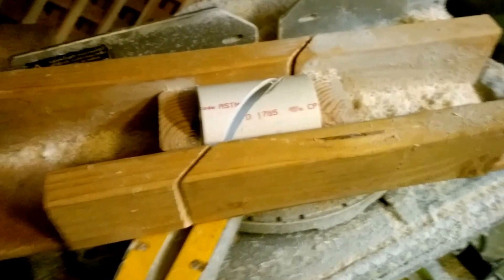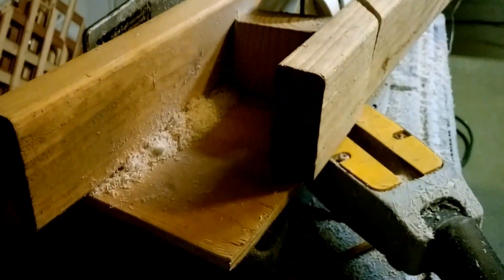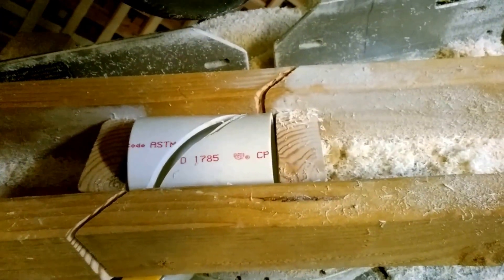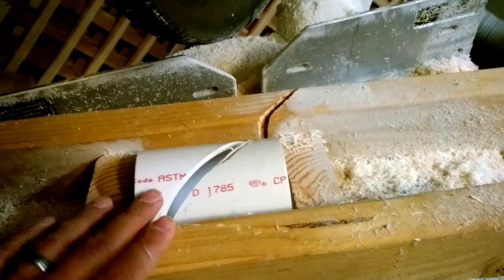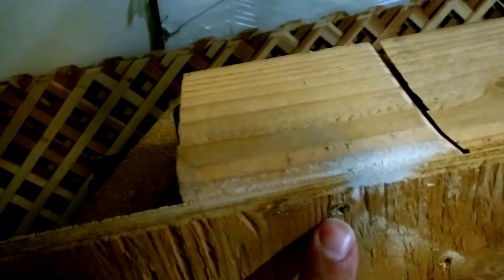Let's take one more look at the jig: simple piece of plywood at the bottom, two-by-fours on the sides, and a couple small two-by-four pieces. Drill pilot holes first before putting in the actual screws from the bottom of the plywood into the two-by-fours. Pilot holes prevent the plywood from splitting and make everything much more secure.